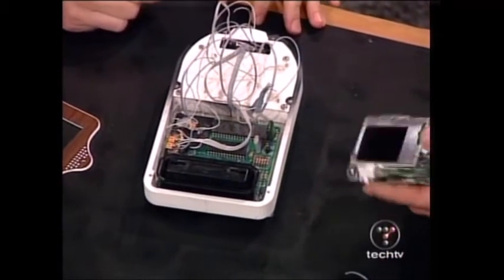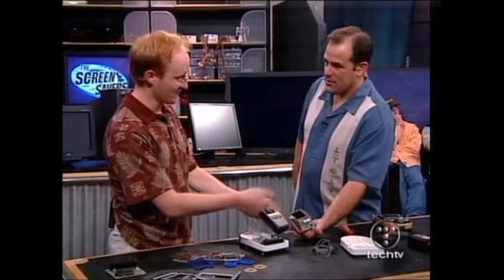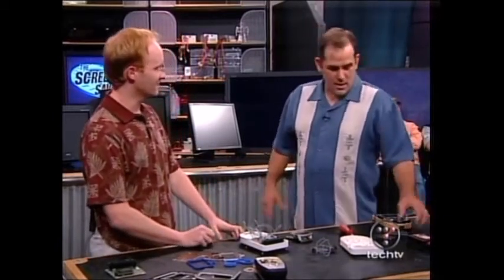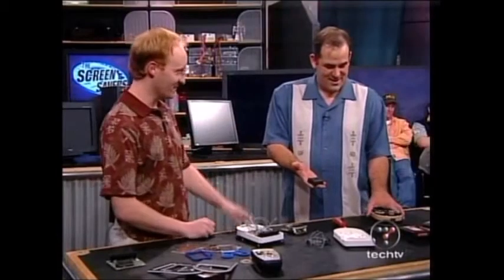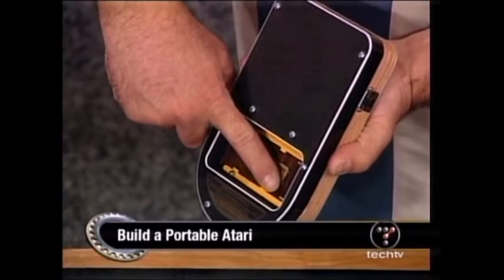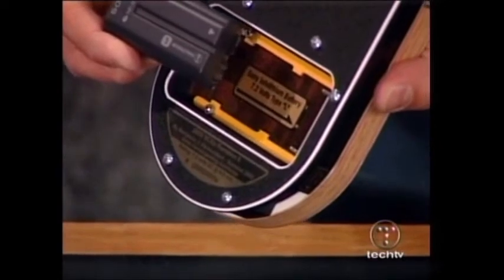This is the screen - it's basically the same as a Casio screen. It runs off camcorder batteries because I had a camcorder that used those and they were kind of small, so I gave it a try and it worked. How did you figure out the adapter? I just went to Radio Shack and browsed through everything. I saw the little Molex connectors used to plug wires together - those look about right. I got those, hacked them up, bent them, blobbed a lot of solder in, and it held pretty good. Basically you work with what you got.